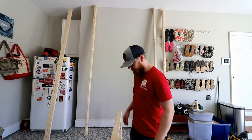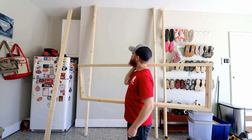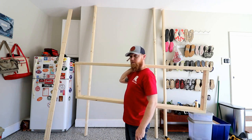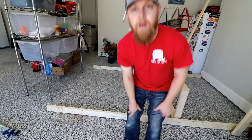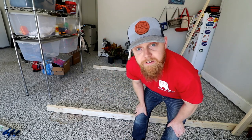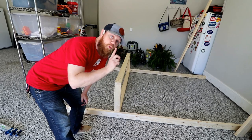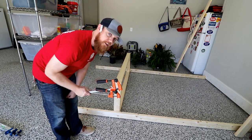I've been thinking a lot, since I'm working by myself, how am I going to attach this to those two 2x4s and then to those two 2x4s. What I've decided to do is this: I know that my first shelf needs to have 36 inches of clearance underneath it, because they want to put a trash can and some other things under the first shelf. So I'll mark 36 inches from the bottom up. For now I'm just going to put one screw in each side to hold this in place and then put a clamp on there to hold it while I maneuver it up against the wall.